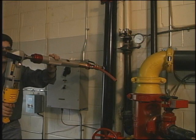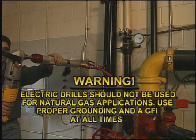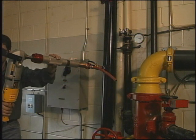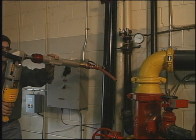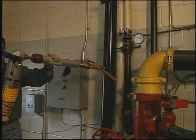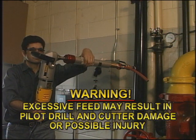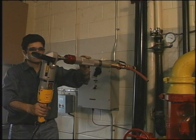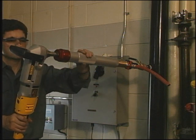For this demonstration, we are using a low RPM right angle drill. Warning: electric drills should not be used for natural gas applications — use proper grounding and a GFI at all times. Do not apply too much pressure on the cutter and pipe with the feed screw. Light, even pressure applied with the feed will produce superior cutting characteristics and help extend cutter life. Warning: excessive feed may result in pilot drill and cutter damage or possible injury to the operator. Continue to drill through the main until no resistance is felt when advancing the feed — at this point, the pilot drill has penetrated the main and the valve and tool are now filled with the media from the pipe.